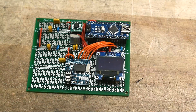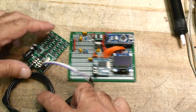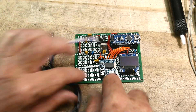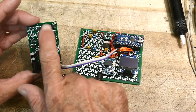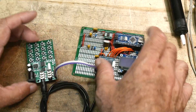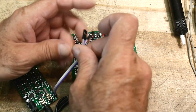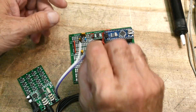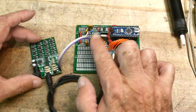To test this out we need to add some circuitry — we need to get a tone in there. I'm going to use this little board I showed in my first video; this is the DTMF generator. We'll use the supplied cable to take the tones out of this and put them in here. This board needs five volts to operate and I already have five volts over here, so I made a little jumper cable.